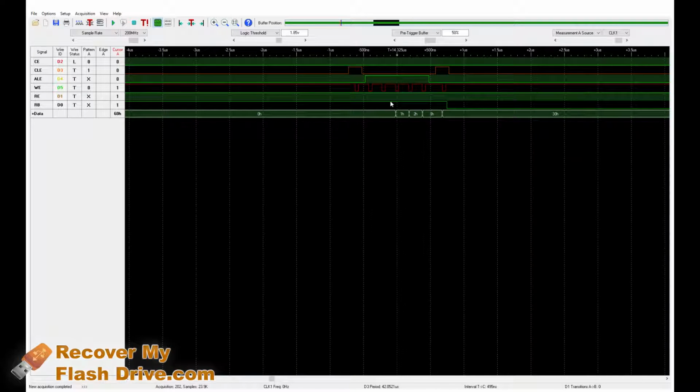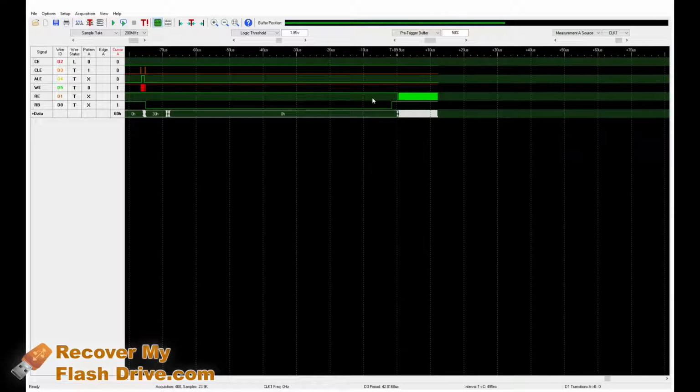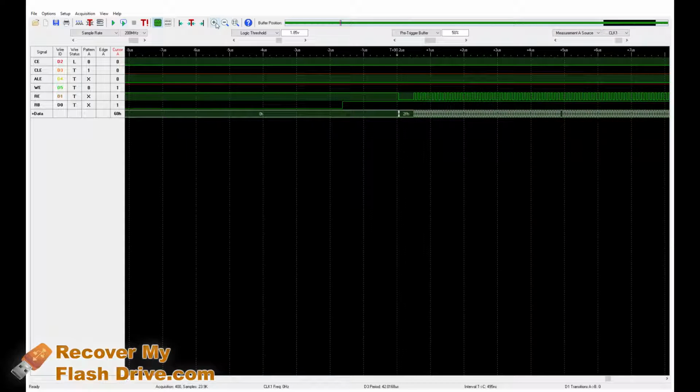And the memory chip is constantly being issued commands to read, which would be 0 and 30 over here, the commands to read the same pages, 0, 0, 1, 2, and 0. And if we actually pull that information up, it'll be a mapping page, so that way it can locate other information inside the drive.